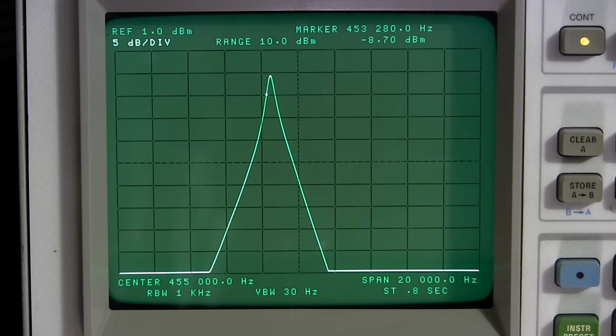So another thing I should mention, and I hear this a lot, and I'm glad that I remembered this, is many people say, when I tune the crystal selectivity control towards position number 5, I notice that the amplitude drops quite a bit, and sometimes the frequency will even shift a little, and that's absolutely normal. Don't worry about it. If you move it towards 5 and you're down in the noise, of course there's something wrong with the section, but it's quite common for this to move. So what I'll do is I'll just give you an example of that right now.